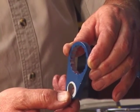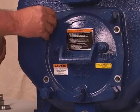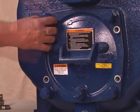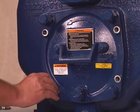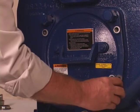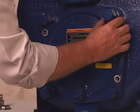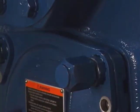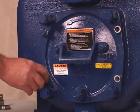The recommended clearance between the wear plate and the impeller is 10 to 20 thousandths. Loosen the hand nuts used to press the back cover into the pump casing one full turn. Pull the collars off the adjusting screws, index them 3 detents counterclockwise, and then reinstall the collars on the adjusting screws. Use the collars to turn the adjusting screws clockwise until the holes in the locking collars realign with the tapped screw holes in the back cover plate. Secure the locking collars to the back cover plate with the hardware.